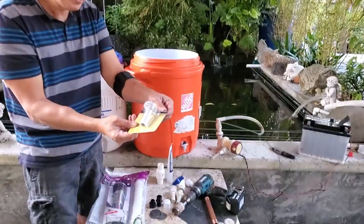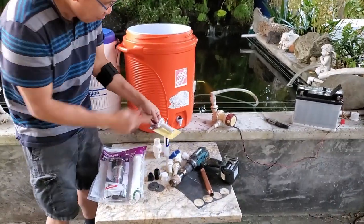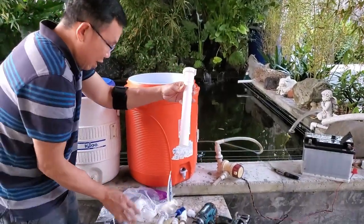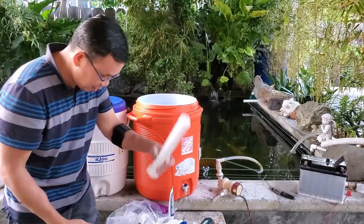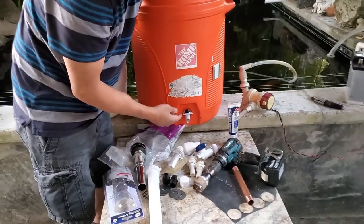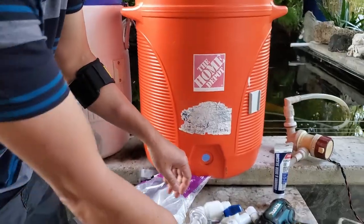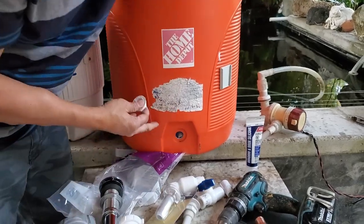Today I'm going to show you this — the sink hole cover. You can buy it for $2 or $3 for the inlet, the intake. And you can use the extension tube — you see this one under your sink — you can use this for the outlet for the water cooler. Simple, $2, $3 and you can do it. First of all, you want to remove this. You hold on the inside and then you twist it, and then you can remove this valve right here.